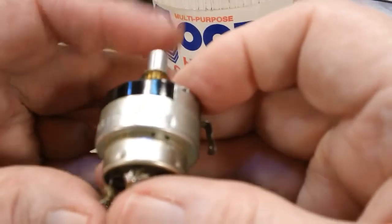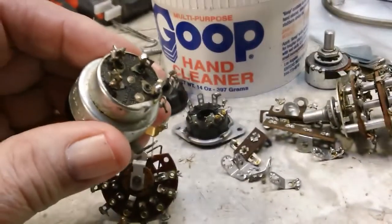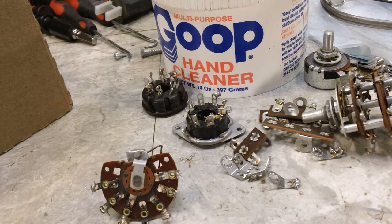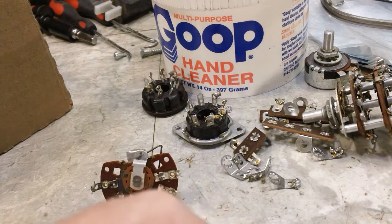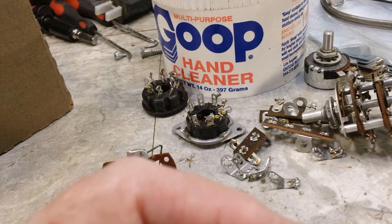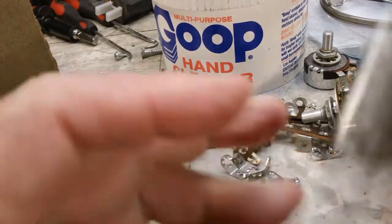I got to looking at this — that's reading 800 ohms. I think it was seven-something on the next spot down, so let me take it to the next setting. It might help if I put it on ohms. All right, 8.892 — so it's 892 ohms. That's not bad, that will work indeed. So our pots are good on the C3, have nothing to worry about there, and that's a good thing.